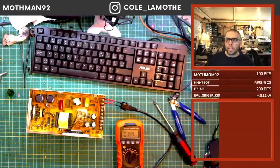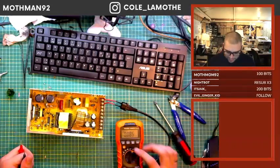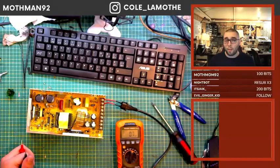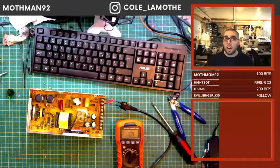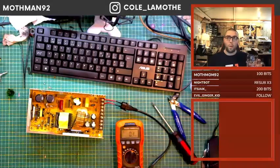It's something very interesting about how we consider our power and how we use these kinds of systems, that that not being equal to 0 volts isn't a problem so long as this whole system is accepting and totally fine with 3 volts being zero. And generally it is. Now if I connect this earth to a different system's earth, I would have 3 volts here and say the other one's actually running at zero. I would actually have a current running from this earth to that earth. So you've got to be mindful about different earth potentials.